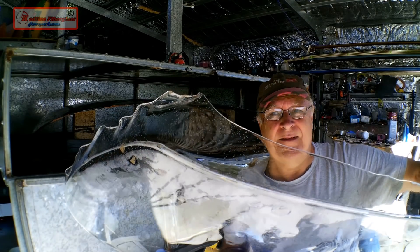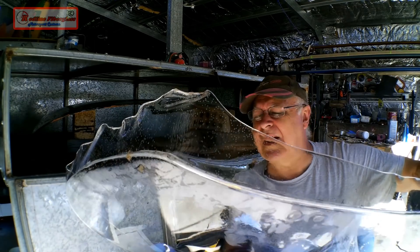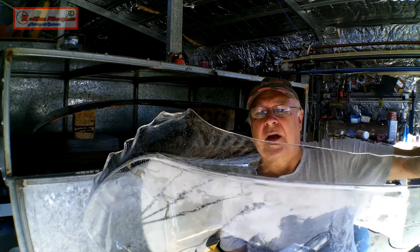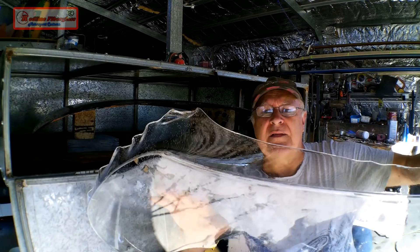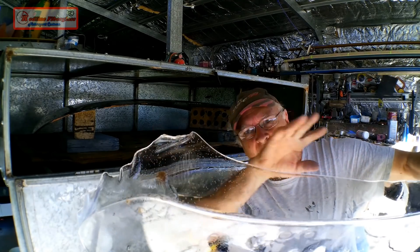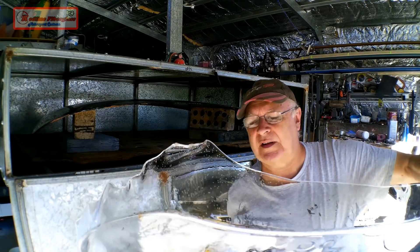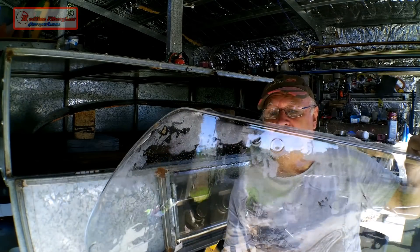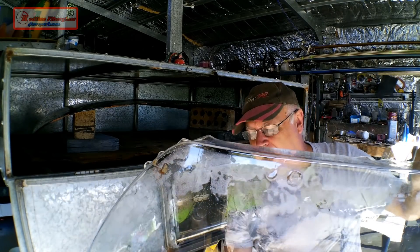Moulding plastic windows at home in a homemade barbecue oven, you're never going to get results as perfect as proper industrial processes. But for a home racer who wants to make their own lightweight windows, this is definitely better than trying to take a flat sheet of acrylic or polycarbonate and put 44 screws around the windows, trying to bend a flat sheet that doesn't want to go into a compound curve. Having heat moulded both polycarbonate and acrylic, I can say that acrylic is definitely the easier way to go — you don't have to pre-dry it and you're very unlikely to get the bubbles that Lexan is prone to.